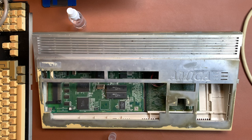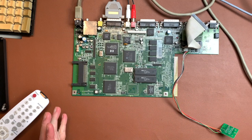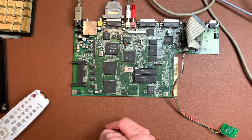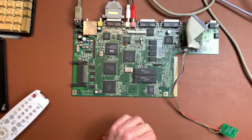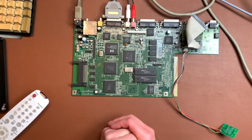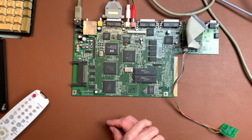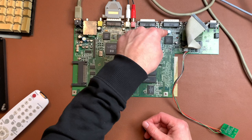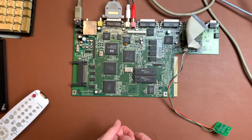I tried to turn the Amiga on, cleaned the board a little, and it just gave me a dark green screen. Consulting the internet tells you that a green screen means memory failure, but I think it's just bad caps — that cap over there has some corrosion around it. I'm going to change the caps but I don't have all of them, so I have to order a cap set. I replaced the ones I had — the 10 microfarad caps — and after replacing those two I now get a dark gray screen, so I might be onto something.